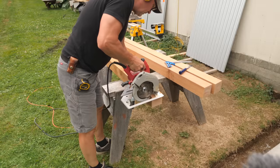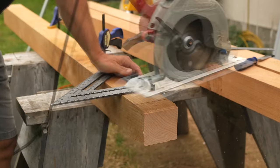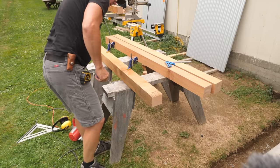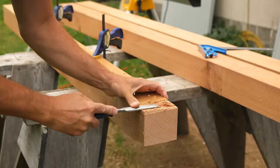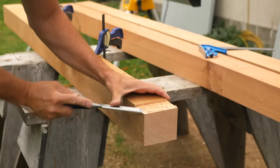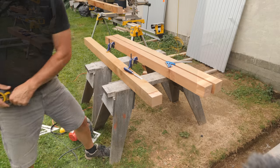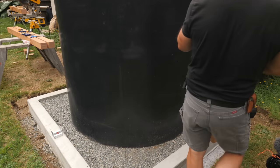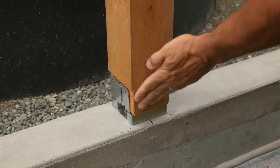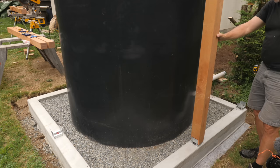The post saddles are designed for a nominal 4x4 which is actually 3.5 inches square, so I need to trim down the bottoms of these posts, then break off the wafer pieces and finish with a chisel. I'll test fit one just to be sure. When we poured the concrete curb I embedded some anchor bolts to hold these adjustable post saddles. I like these as they lift the post off the concrete by an inch and they are slightly adjustable — I find that my anchor bolt placement can be off a bit so this really helps.